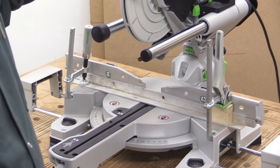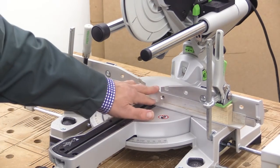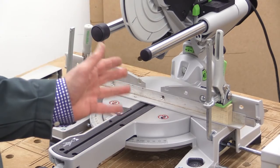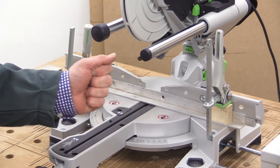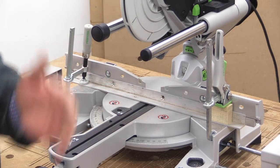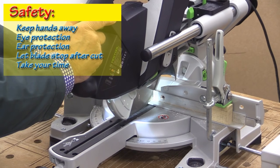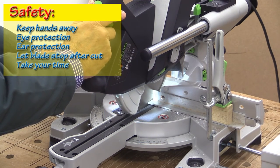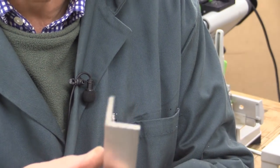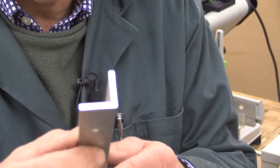I've got the aluminium blade in and I've set the speed to four, about mid-range of the allowable speeds. I've got a piece of aluminium angle secured at both ends, and I've disconnected my extractor — the reason being I don't have a spark guard on the extractor, so I'm not going to risk cutting metal with it. I've got eye protection and ear protection, of course. That's an absolutely perfect cut — it was effortless, as though I was cutting a piece of softwood. That is absolutely beautiful. I've never cut aluminium like this before — not a piece as thick as this.